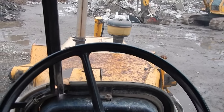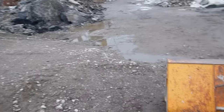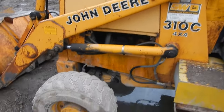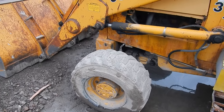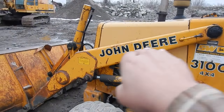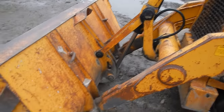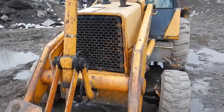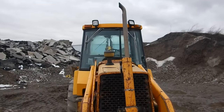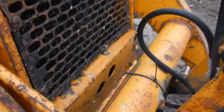This machine was a bunch of firsts for John Deere — it's also the first 310 to offer four-wheel drive. Oddly, the larger B-series machines got it first, even though the 310 was their best-selling machine at the time. This is the angled loader — it does not have the 90-degree loader. The Y-link design is for the front bucket, which is a one-yard bucket, 88 inches wide — the tractor itself is 82 inches wide. Two lights on the front of the cab — this is a snow removal machine so it needs lights. No counterweights installed on this one.